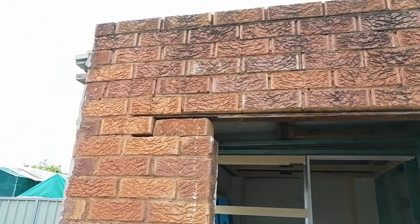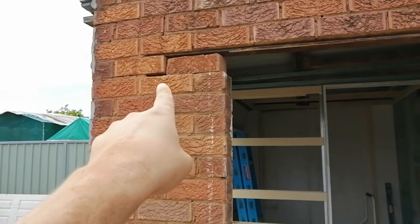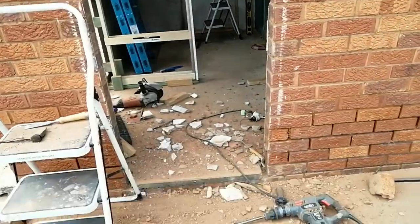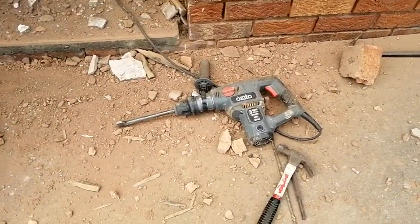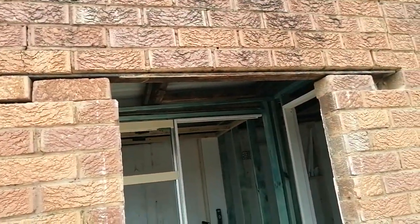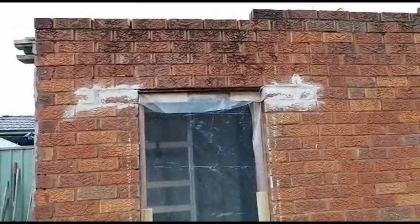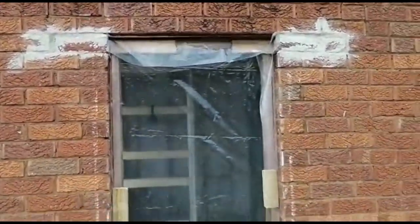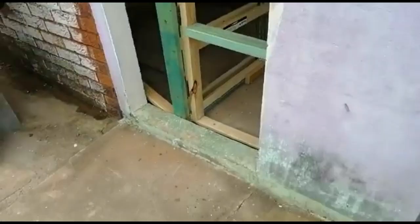Okay, knock that line of bricks out, move the steel support up above. Now I've got to glue in another brick, glue that brick back in with mortar properly, and then one and a half bricks that side and then we will have a big enough entry now for a proper door. Used a little mini jackhammer kango kind of thing to pop the bricks out - try to pop them out slowly one by one to preserve them. Got a whole day of work done, my dad came and helped me. So we removed that line of bricks, moved that steel header up and patched a couple of bricks - looks terrible but I'm gonna clean it up once it's dry. Put a door jam in. From the inside you can see we started closing this in - beautiful door jam.